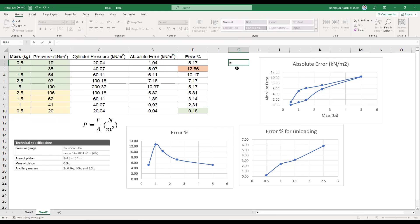This analysis gives a lot of good information about your gauge — the average error percentage and how accurately it represents pressure data. Taking an average of these error percentages, I can report that this gauge has an average error of 5.75%. In this video I showed you how to calibrate and find the error percentage of a Bourdon gauge using dead weight calibration. If you like the video, please subscribe and give it a like.